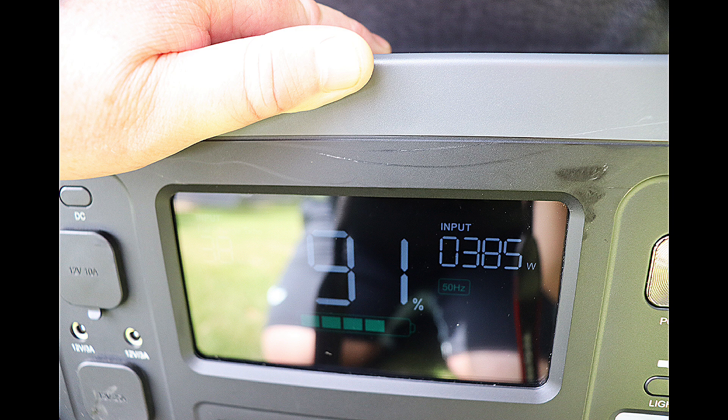For those wondering about the conditions, I turned the camera around at exactly this time: it was quite a hazy day with a fair amount of cloud around, intermittently cloudy and clear. At 345 watts it was in a clear patch but still hazy. The best I saw on this not-perfect day was 385 watts — more around midday with the sun at its highest, angling the panel in the right direction and at the right upward degree of angle to try to get perfect generation. I tried moving the panels around, misangling a corner here and there, looking at it a bit shallow and a bit steep, and it didn't affect the generation that much — so you don't have to be that precise. Anywhere roughly in the right direction and you're going to get decent power.